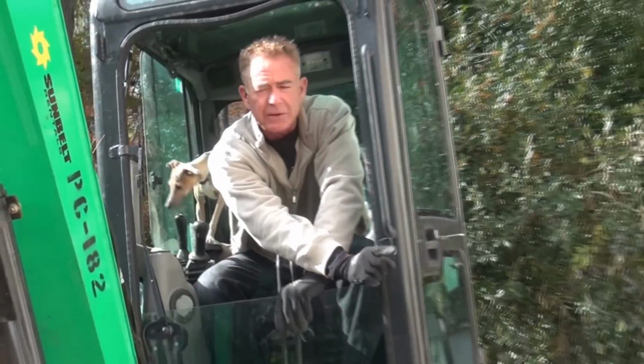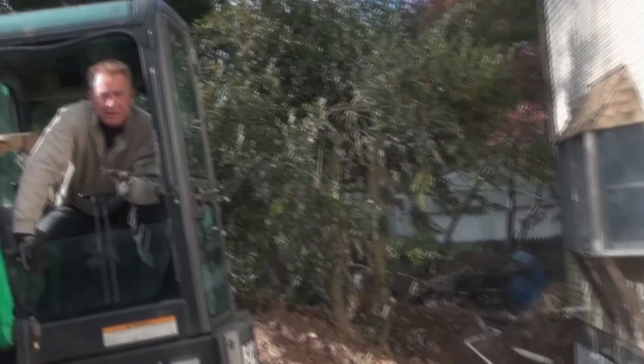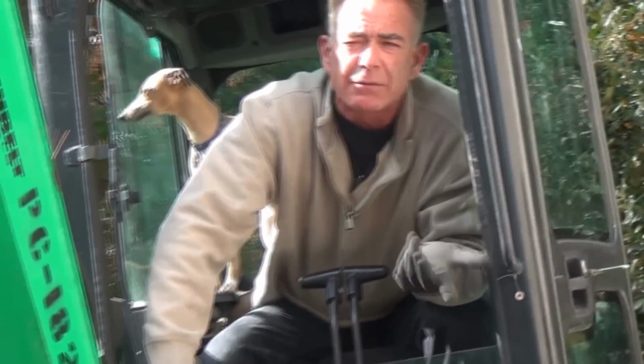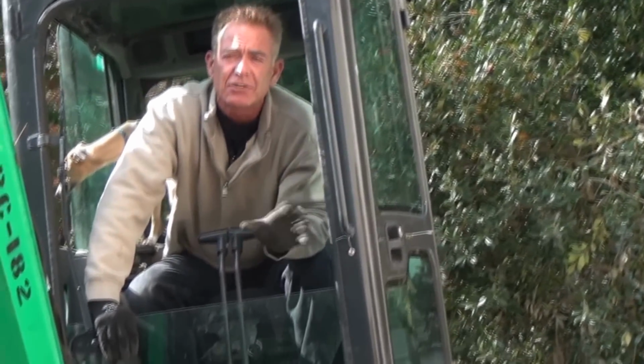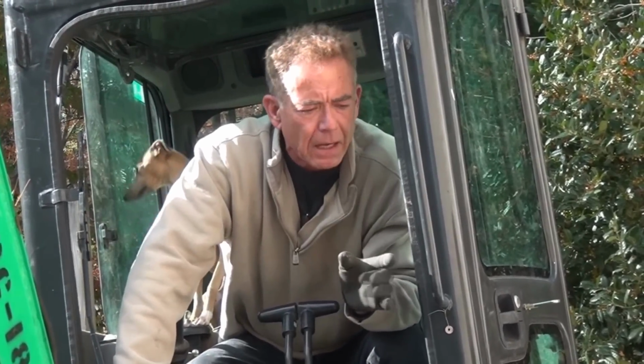We've reached a final process in this job. If you look at how we finish the walls, now that is a 20 mil rubber plastic reinforced. You cannot penetrate it. It comes in 12 foot by 100 foot lengths. You can completely encapsulate the outside of the foundation. What we do is we'll power wash the outside walls, we'll put tar on there, and then glue the plastic to that. No water can ever penetrate it. That rubberized plastic will be there forever.